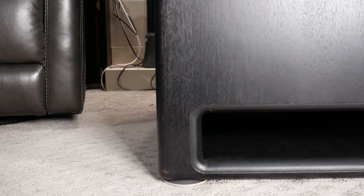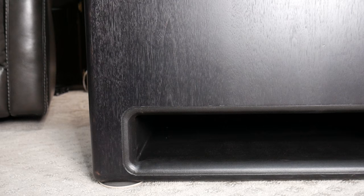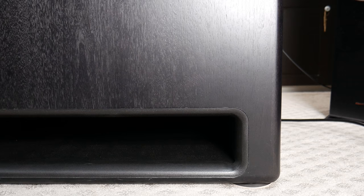And I quote, "We have not offered many ported subwoofers over the years because so often a port design must be compromised in some way or another, especially for an ultra-low tune design. Either we have to make the port too small and live with port noise, or you have to make it too long and limit the upper range of the subwoofer due to pipe resonances. Often a design must balance a bit of both, and as a result, some aspect causes unwanted noise long before maximum output capability is reached.